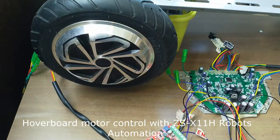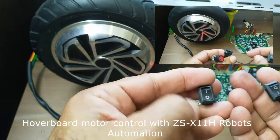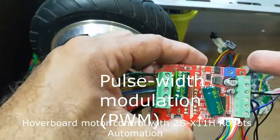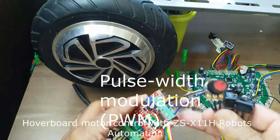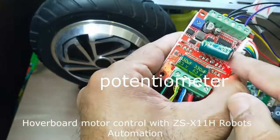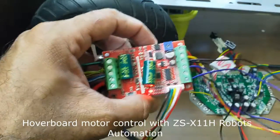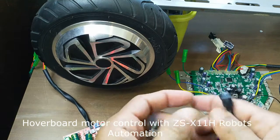Now I will show you how to run this. I will connect the power adapter. You can see the power supply light is on. There is reverse/forward, one for enable which is the start/stop switch, and a PWM controller — it actually has PWM onboard itself. If you want to control from here you can, otherwise you can connect an external potentiometer. There is also a jumper here — if you put the jumper it will disable the onboard control and then you can control by an external potentiometer.